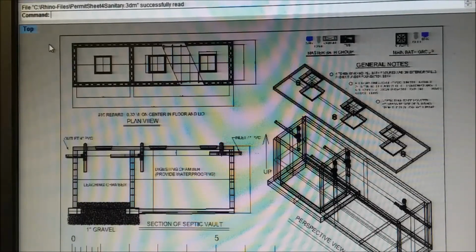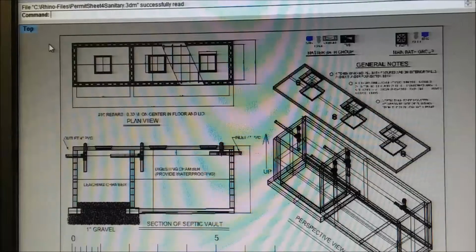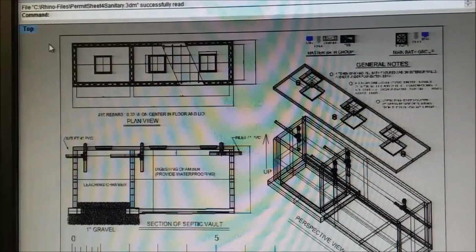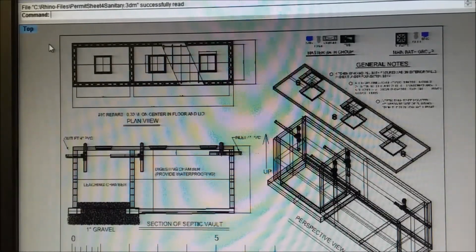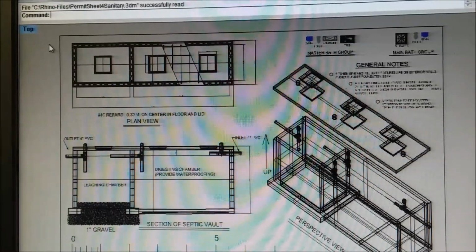We weren't originally going to have anything but security grills in some of these holes so we get air circulation. But we got four or five outs on this. Not like we put ourselves in a corner. But the fire department can require more doors. They can require a wider hall. If your hall is not a meter plus in width, ours was 36 inches because it wasn't to be used for anything. It was just an emergency escape hall. It really didn't do anything. It was just in the drawing. But they required it to be wider.